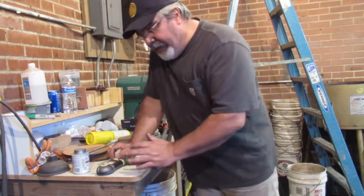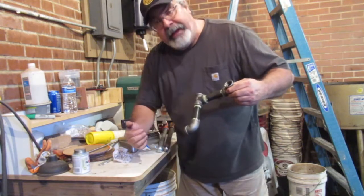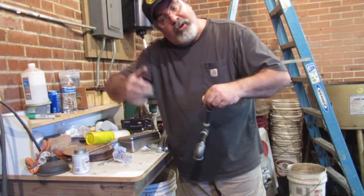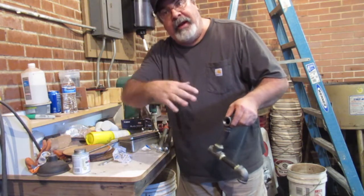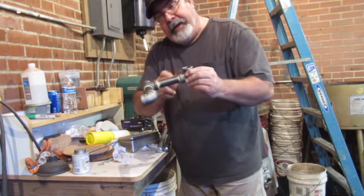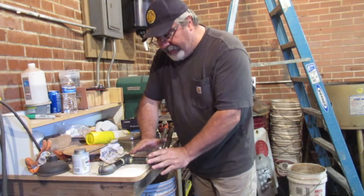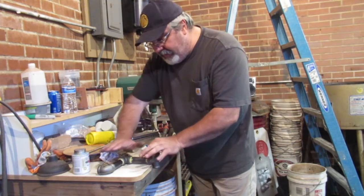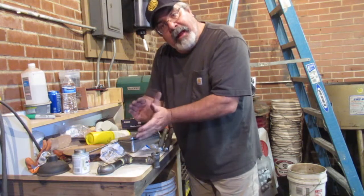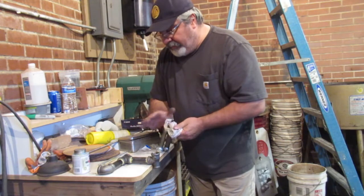Okay guys, I got this stuck together. I do have to put a leg coming down here. I don't want to put too many parts on, because when you're putting it onto whatever you're putting it on to, things start getting in the way. But here's the thing: this is all the same height. I got this on the bench and this is all straight, so I know everything is 90 degrees or perpendicular to each other. So that's a trick you can use.